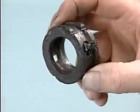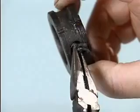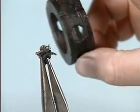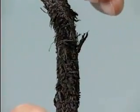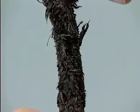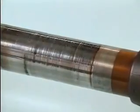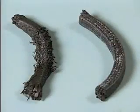A clogged lantern ring or gland sealing line prevents essential lubrication from flowing through the packing gland. These situations require a thorough cleaning of the clogged parts. Worn or damaged packing is one of the most common pump problems. If the packing is damaged, it will not provide adequate sealing of the stuffing box, resulting in excessive leak-off out of the packing gland. Packing that is worn, damaged, or inadequately lubricated can also damage the shaft. Packing that is worn or damaged must be replaced.